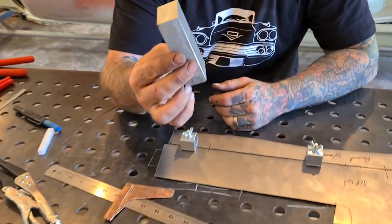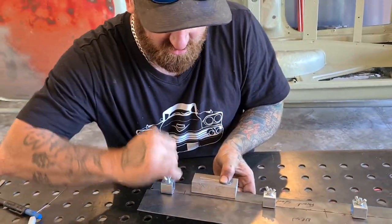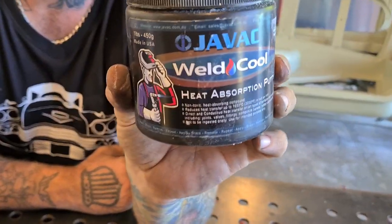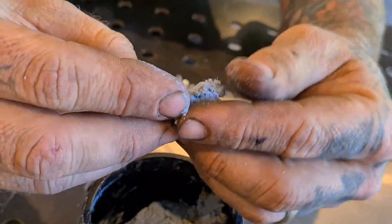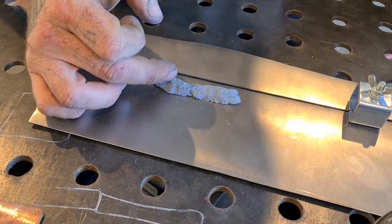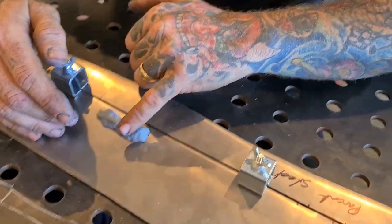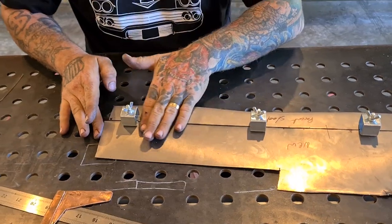Another thing you can use as a heat sink — even if you can't get to the back of the panel — is aluminium blocks placed close to the weld; they'll still draw heat out of the metal. Another product I don't see many people showing is this stuff: JVAC Weld Cool. JVAC is the brand, but it's heat absorption putty specifically designed for this. It's sort of like playdough with some polymer in it. You just stick it beside your weld — it's reusable, non-hazardous. Just keep it moist; if it starts to dry out, add a bit of water.